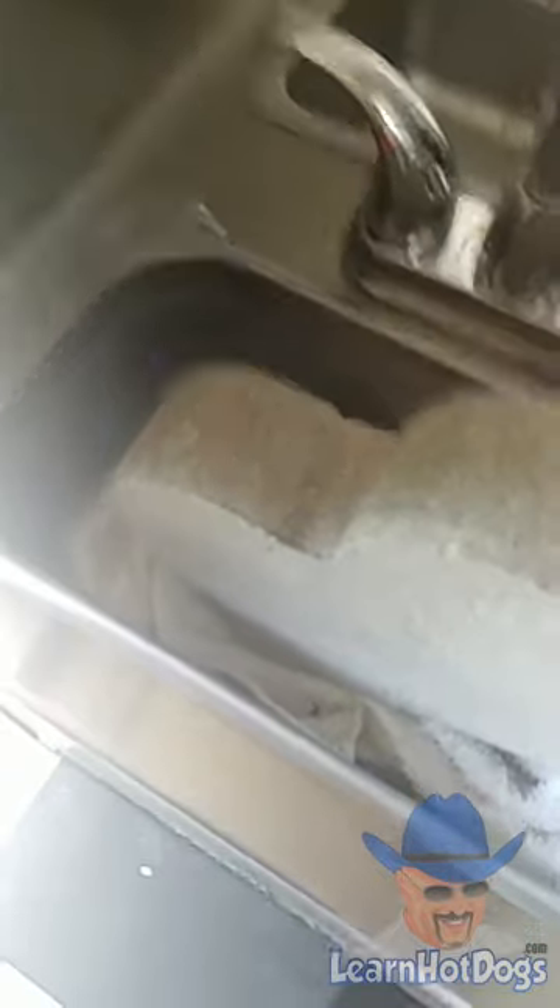Side note guys — on this same thing, there's my brick. I already put my sink back in and caulked it. And if you notice I got caulking seeping out on the sides right there. All you got to do is let it dry, then take a razor and just cut around that — it'll peel right off. It doesn't take anything at all, but let it dry good before you do that.